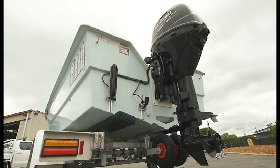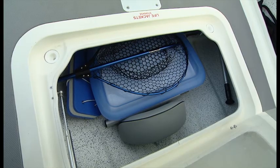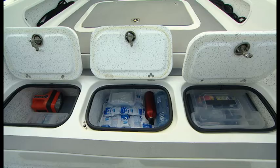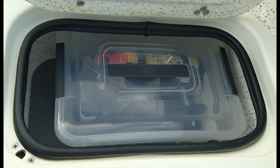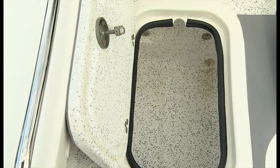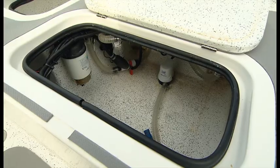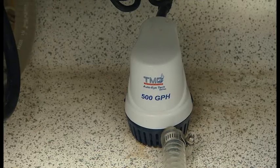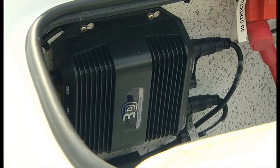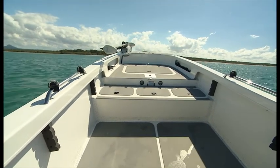You can custom order the layout you want. This one has a large storage area for life jackets etc. under a big waterproof hatch in the forward casting platform, which also houses two 100 ampere hour batteries. In the step up to that platform there are three hatches which open to tackle and spare storage on either side and a food and drinks chill box in the centre. There's a live bait well or aft anchor locker or chill box under the starboard side of the aft platform, with a 45 litre aluminium fuel tank under the port side. Under the centre hatch of the aft platform are the fuel filter, live bait and bilge pumps, and mounted on the forward bulkhead are the electrical switches and 3D side scan black box. All these items are to the side and forward of the drained hatch opening and cannot get wet when the boat is washed after use.